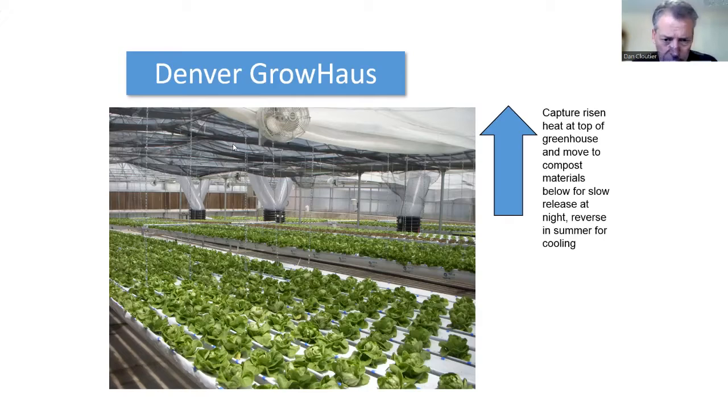Now, in the wrong kind of structure, you're applying a great deal of heat up at those heights because you're literally forced to undertake a philosophy that says we will melt the snow as it arrives, in this case on the polycarbonate, because if too much snow builds up on the roof, we'll have literally a cave in. So not great. Now on the right kinds of structure, a tension membrane building, we have no risk of that snow cave in. The buildings have the shape and materials that just have the snow shedding, whether the building was heated or not wouldn't matter.